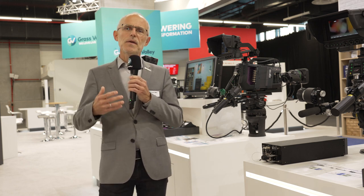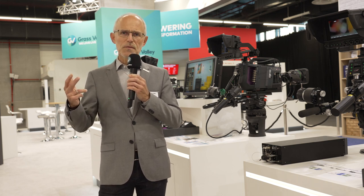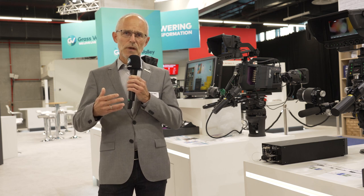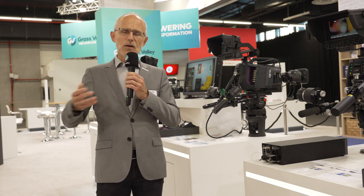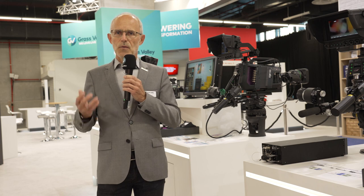In the case of the 135, we can activate two different encoders for two outgoing streams. They can be set between 5-to-1 and 20-to-1 compression ratio, and we can also use two decoders for incoming streams for return video or additional signals required on the camera.